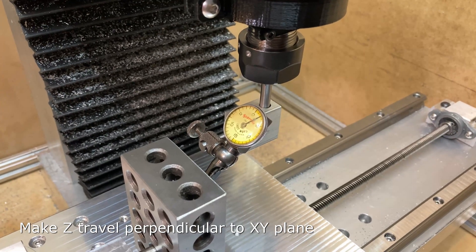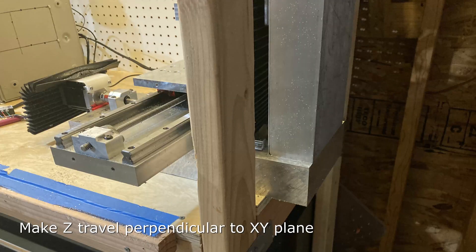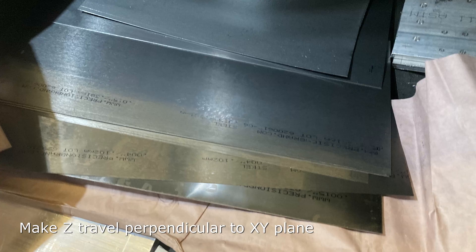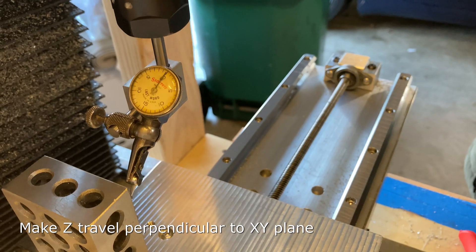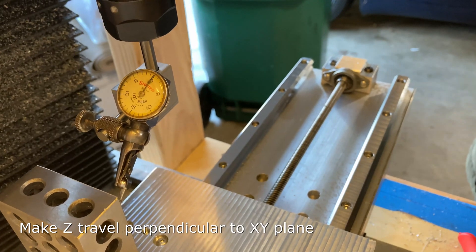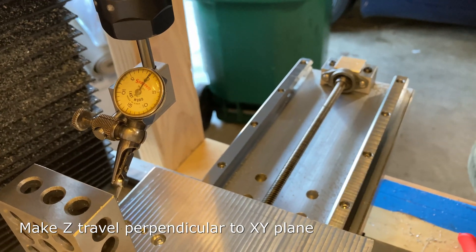This indicated only a slight error in rotation of my column. To fix it, I moved the mill off the edge of the table to access the bolts going through the base into the column. I loosened these bolts just slightly, enough to fit some steel shim stock underneath, then clamped the bolts back down and remeasured. The shim stock comes in thicknesses in increments of one thousandth of an inch and is pretty precise. After adjustment and shimming, the error was just under a thousandth of an inch per two inches — about half the original error.